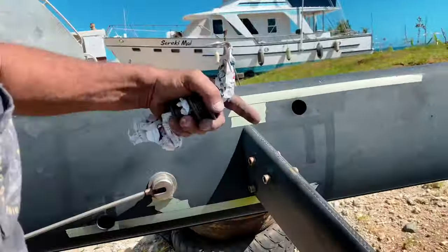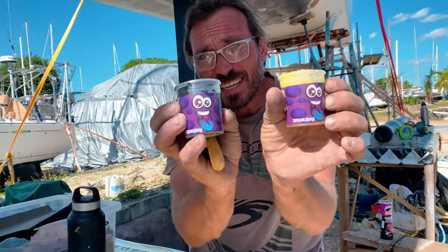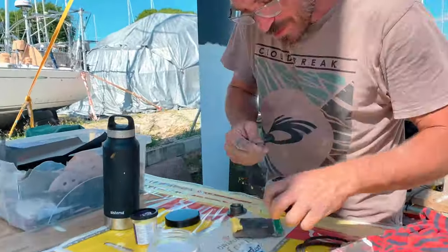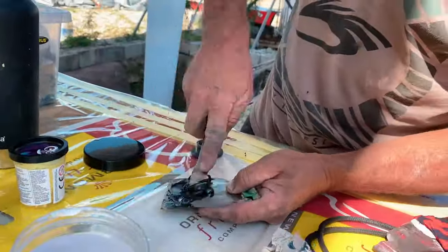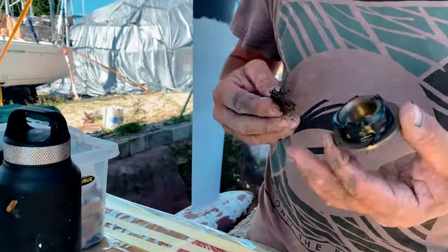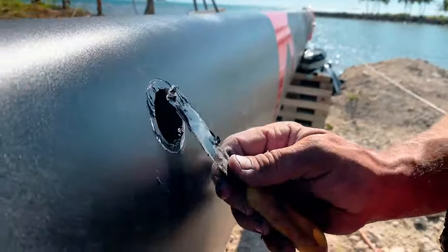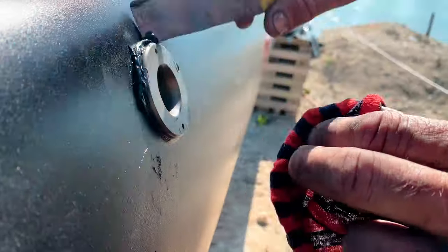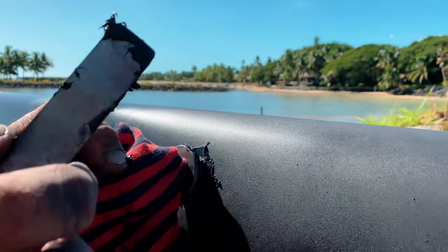We glued four ferrules into these holes using a two-part high-strength epoxy glue. These ferrules reinforce the structure and help to distribute the force more evenly. Once this was done, we put the mast back up.